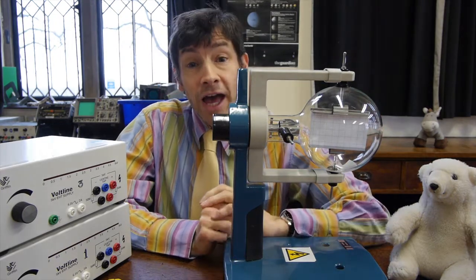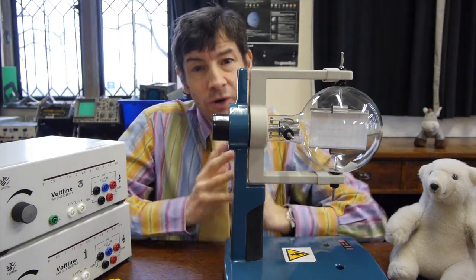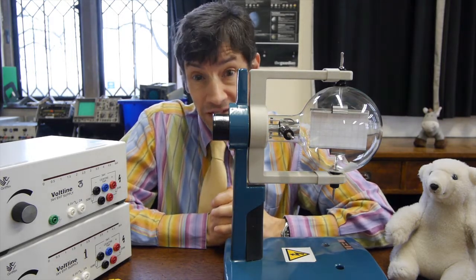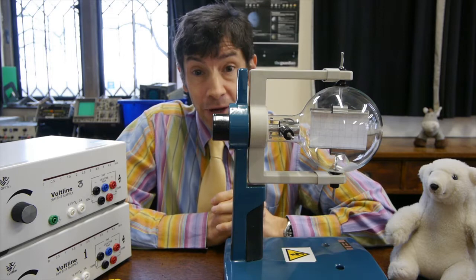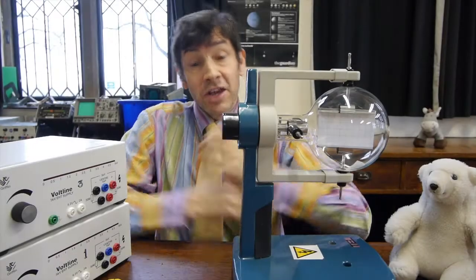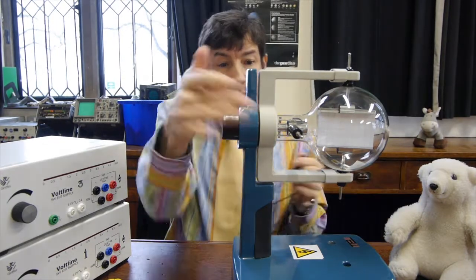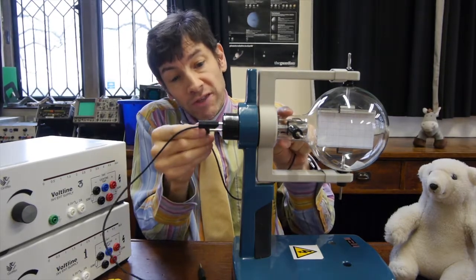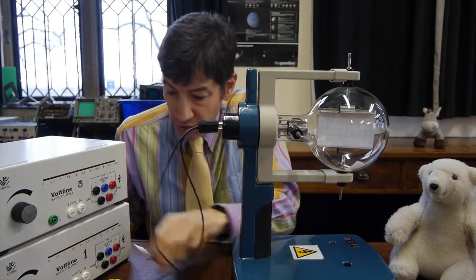I'll put the tube back in the stand and we're ready to get started. This is going to be quite a complicated video, but don't worry — don't give up when you get to a complicated bit. There's lots of bits of information you can take from this, so even if you don't get the more difficult bits of physics, I'm sure you'll understand the slightly simpler bits. So let's get this working. To get an electron gun working, you might remember we have a hot filament at this end, and if it's a hot filament you'll see it glowing when the tube's working. I'm going to plug that in using this lower power supply, to 6.3 volts AC.